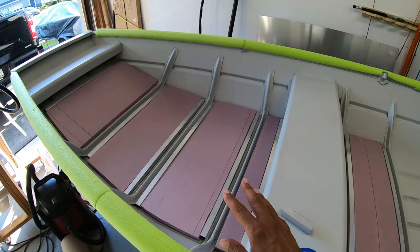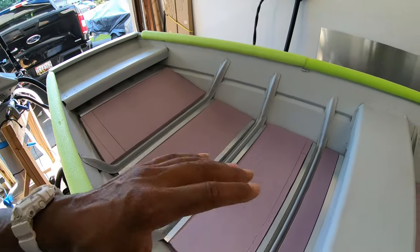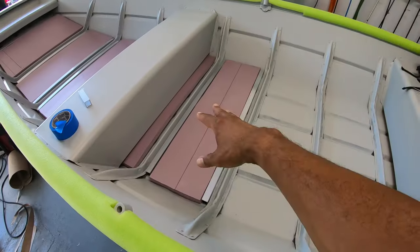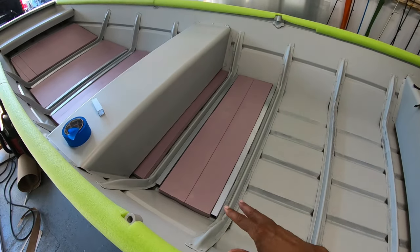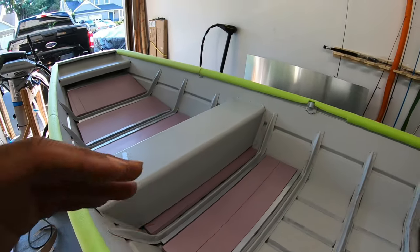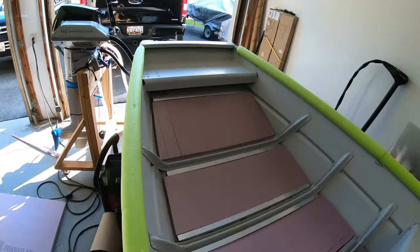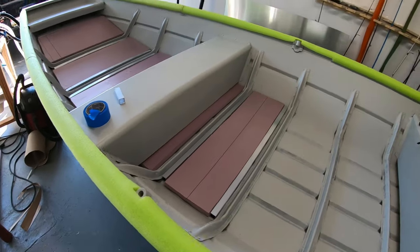Because I'm going to put a subfloor here, what's going to be the additional support? These tubes will be glued in, and even though it's going to be glued in, there's going to be framing on top that will ultimately secure it down even more. Back here I'll have two hatches secured down by the actual framing of the boat, which will connect to the side rail. It's one big puzzle that's going to come together in the end and be one secure structure — very satisfied with how this is coming out so far.